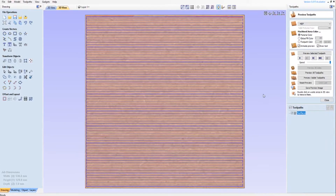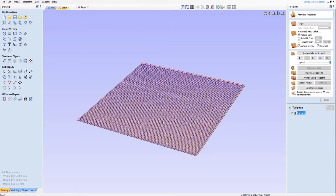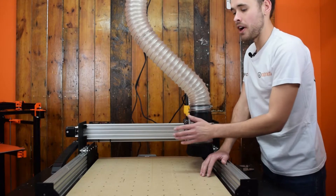For how we set this up in our CAM software, we had a rectangle job equal to the width of the maximum travel distance of this machine — not the width of the spoiler board itself. And then we just set it to cut on the inside, offsetting the whole way along.